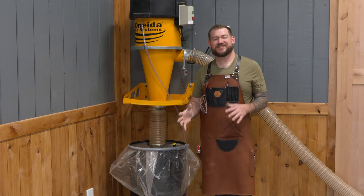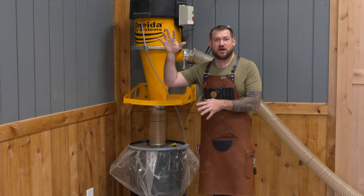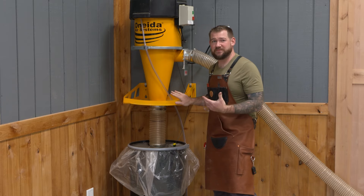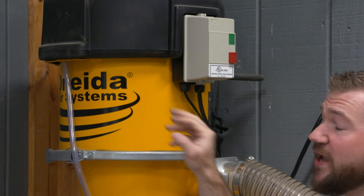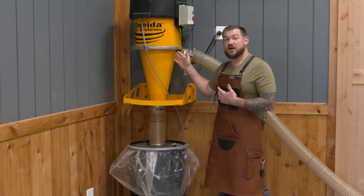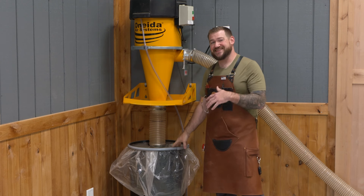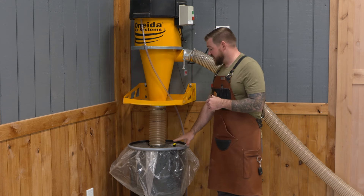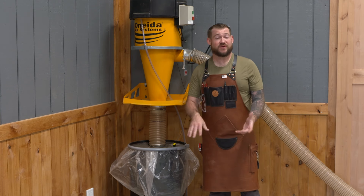The Supercell is a two-stage dust collector. A single-stage dust collector is the cheaper version with a blower on the bottom, a bag filter on top, and a collection bag below. The Supercell's two-stage system has a series of fans inside which is what causes the high static pressure. Those three fans blow air up and through a filter, pulling air through the dust collection port — which has a blast gate. As dust enters, it spins around in the funnel in a high-low pressure system that causes it to drop down into the collection bin. The Supercell is available in several configurations: the 30-gallon wall-mounted unit we have here, a 55-gallon, a smaller 14-gallon, and a mobile unit you can move between tools.